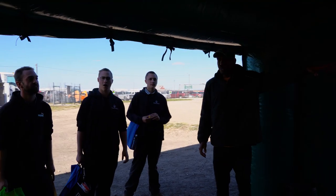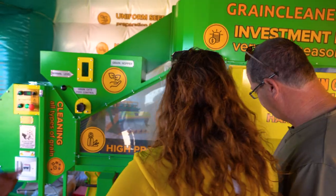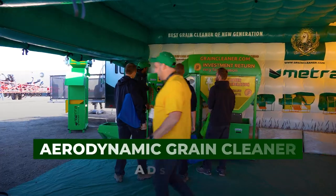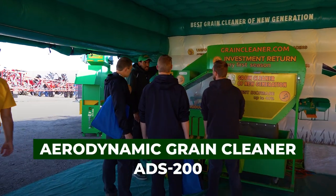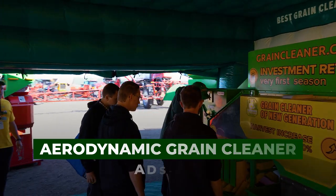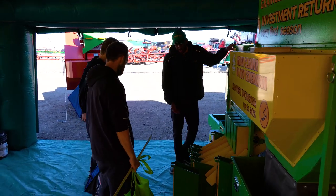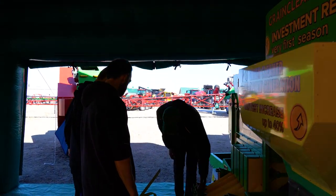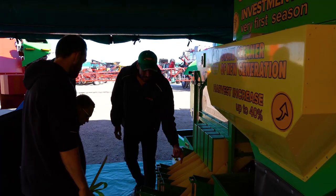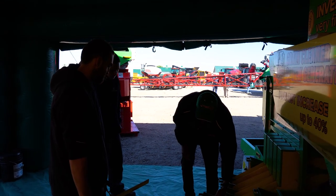So with this one, you can do all types of grains, from corn to soybeans or whatever, and there's no screens. So basically what the machine does, you feed it up here with the grains, and you go from the heavy, to the lightest things. So here you're going to have the heavy grains or the heavy trash that you have. Here the seed quality you have, the good grains. So at the end, you get more trashy grains because they are lighter.